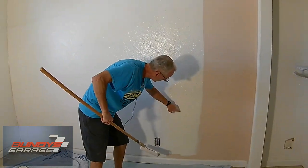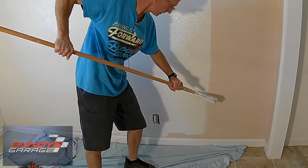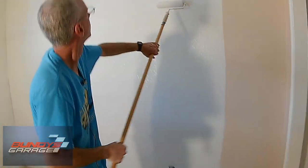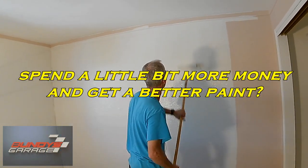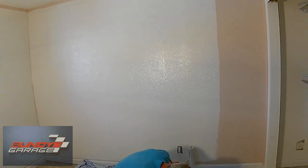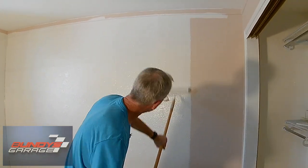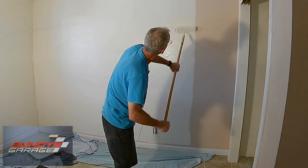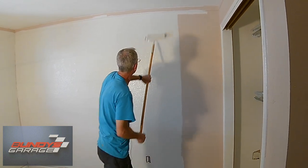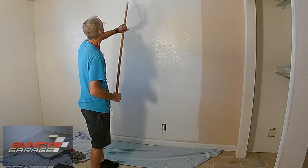See how I'm getting a line right here — that's because it's too wet on this end. So sometimes I'll take that off and just wipe it all up so I'm not leaving an edge anymore. Spend a little bit more money to get better paint, good roller. Definitely use a pole — if I was having to do all this by hand, I would not be able to cover nearly as fast. That's an eight-foot ceiling and I can do it all in a matter of seconds without a step stool. A little four-foot screw-on extender makes a huge difference.